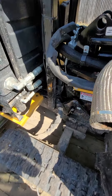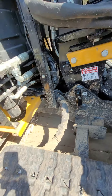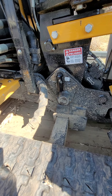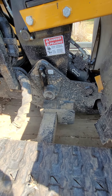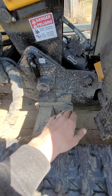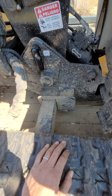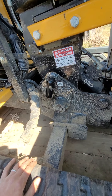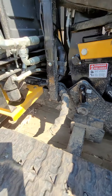I didn't use this pivot pin for a little while. On my 2550 Bandit I kept the cutter wheel head on the deck of the trailer and never pinned it up. What happened was the cutter wheel seal blew out because the wheel was just barely vibrating and bouncing off the deck. So from now on I'm just going to keep these pinned up. They obviously give it to you for a reason — I would suggest doing that.